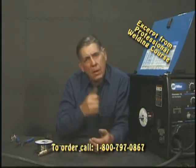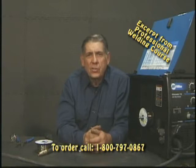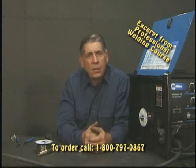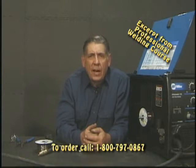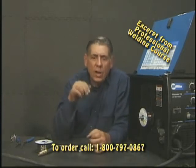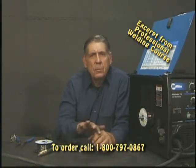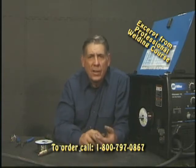So they took the machine out in the field and tried it. Works great until the wind blows. On a nice bright sunny day with no wind it'll work, but if there's any breeze at all, forget it. So they went back to the drawing board. Somebody came up with the idea of putting flux inside a hollow tube and made a spool of wire that way — that's what we call flux core welding. As the arc forms, the flux creates a gas that keeps the weld shielded so we don't have Swiss cheese, we don't have porosity.